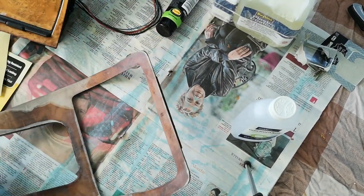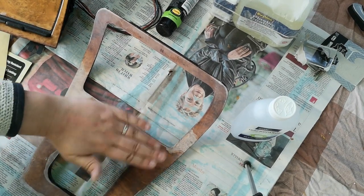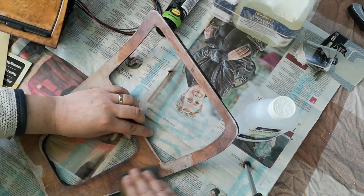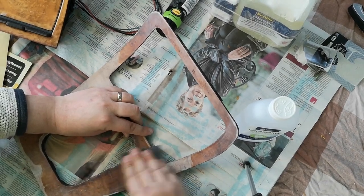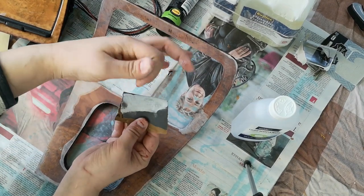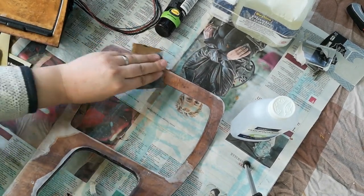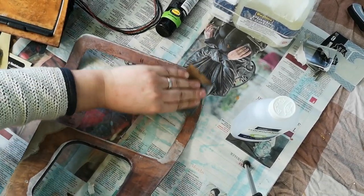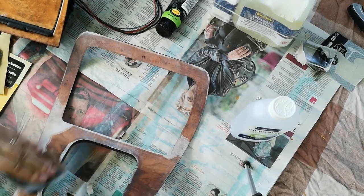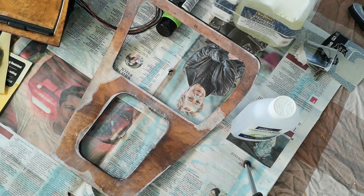Let's see how that looks. That's got rid of those quite deep scratches from the 180 grade power sanding. That's actually done a nice job — it's brought those back quite pleasantly. It's quite interesting that it leaves what's like a clear-coat surface. The initial 180 grade sand was to basically thin out this varnish layer, and that's done the job perfectly. Let's grab a bit more isopropyl alcohol.